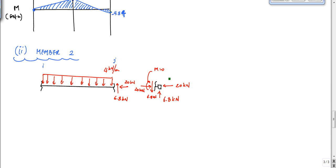Now I could try to draw this diagram. I have called this N-I and N-J. According to what I've done, plus X goes this way, and plus local Y goes upwards right here. I could try to draw this going right to left if you're comfortable with it. For those of you who aren't comfortable yet, what you have here is you're going to calculate the reactions at the face of this cut — there's going to be a normal N2 at N-I, a shear V2 at N-I with positive up on the right side of the cut, and a moment M2 at N-I. We're going to use equilibrium equations to solve for these.